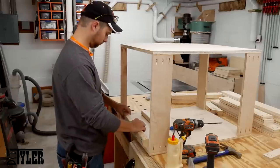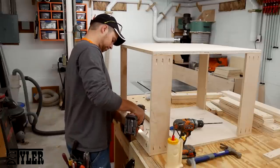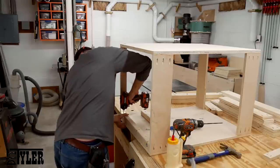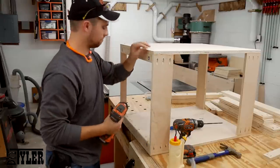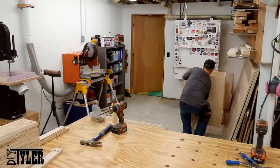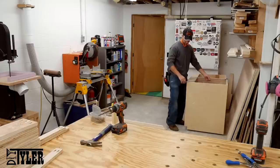These are the solid wood additions that allow me to put the leveling feet in the frames, and these are just glued and screwed through the pilot holes that were drilled earlier. A little tip for time saving here is that I added the bolts while it was on the bench so that I didn't have to lift the frames up again and add them later. Once I set it down, I did check for one final square.